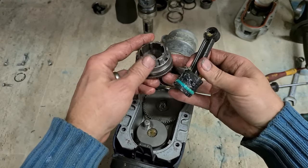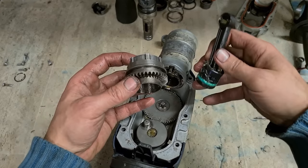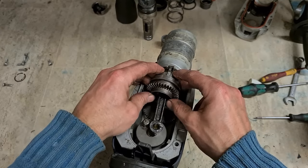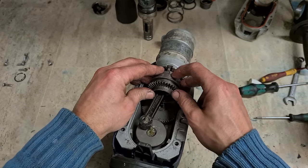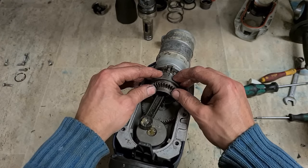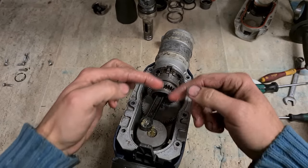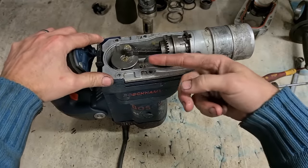So you install this, it faces the back. It's meshing onto the clutch. This smaller one faces the front. Just drop it all down. Line up your piston. Drop these into place. Push down your piston. Just keep this gear facing back the way. Goes forward now, the two shims can drop out and foul up your tool holder as you're putting it in.